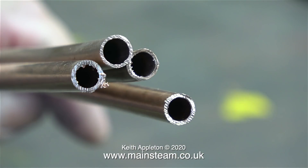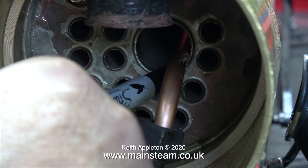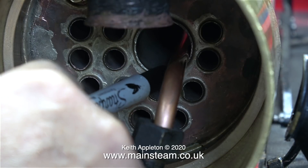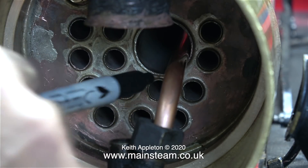As a comparison, here are four pieces of tubing. The two outer ones are the ones I'm going to use and the inner ones are from my normal stock. I bent the end of one piece of copper tube at a right angle and now it fits in the nut on the end of the main steam inlet. With the nut in position and the pipe in the correct position, I'm using a felt tip pen to mark where it exits the superheater flue.